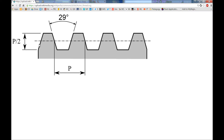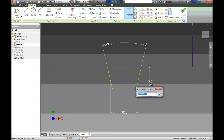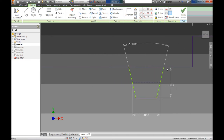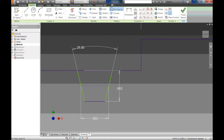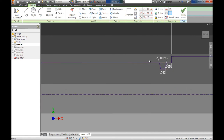We also know the height of the tooth is our pitch divided by two, so I'll dimension from the top line down 0.125 divided by 2. So far we have our tooth design, but it can still move around. We're going to start our tooth half of our pitch away from the beginning of our shaft, so I'll go to Dimension, from our pitch line to the vertical line, and also enter 0.125 divided by 2. Now I can go ahead and finish the sketch.